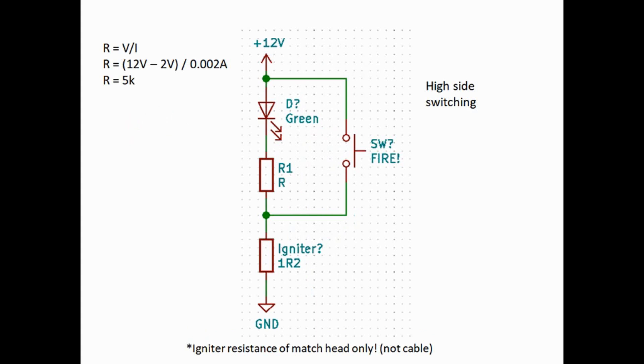Let's discuss how we can check continuity, because continuity is quite common on most systems — although the concept is actually generally flawed, and we'll discuss that in a moment. What I've done here is added a green LED and a resistor before our igniter. We know from the datasheet the no-fire current is 180 milliamps, but that's way too much. We'd normally test an igniter between 5 and 15 milliamps; old systems used 25 to 50 milliamps. Generally we go for the smaller current these days.